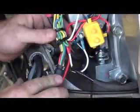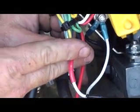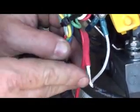We'll talk a little bit about electrical troubleshooting later. But you want to cut these wires when you're removing this. Cut these wire ties off and go ahead and break the connection where the connection is made. Break it where the white wire and the brown clutch wire coming from your handle connect. This is where you'll cut them to remove your clutch.